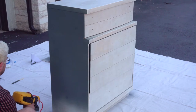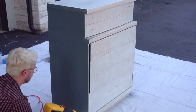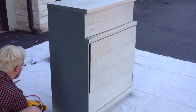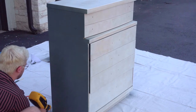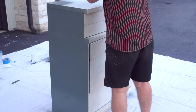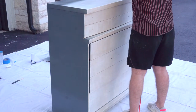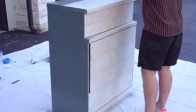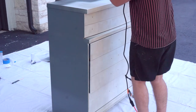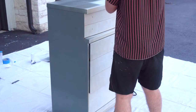For me I've been keeping the air dial at a four or a five and that's working perfectly. As soon as I pulled that trigger I knew this was a game changer and that our days of rolling paint were over. This thing felt awesome to use and we got insane coverage with just one coat. There is a little bit of extra paint waste compared to rolling, but we're buying our paint from Home Depot for $25 a gallon, so honestly not super worried about the cost.